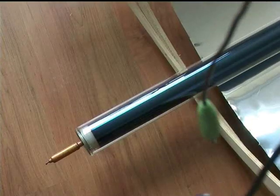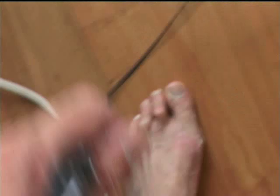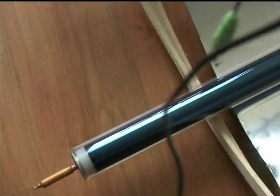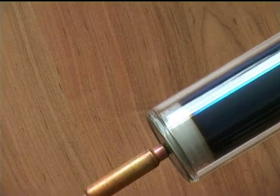I also have a vacuum tube. Here's the vacuum tube that I want to put in the focal point of this parabolic trough. It's a glass one and it's a little bit warm — it wasn't even in the sun, just some daylight on it. This type of vacuum tube has a heat pipe in it, so you have to tilt it upwards so the liquid that vaporizes can end up at the top, and then you can siphon off the heat from this copper thing. These ones are 20 euros, so it's not very expensive.